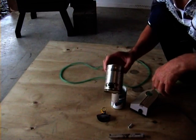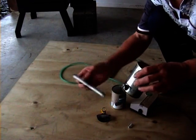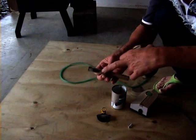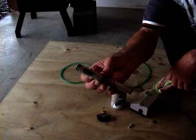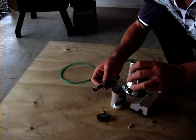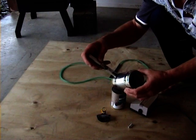One of the tins I've emptied out — I'm going to drill four holes in it. One hole is the same diameter as my outlet pipe. Note my outlet pipe has got a little hole already at the top end here, which helps it act as a venturi, sucking in the air. The outlet pipe simply fits in the side here.